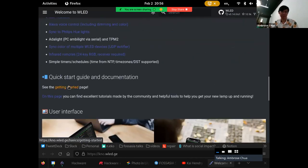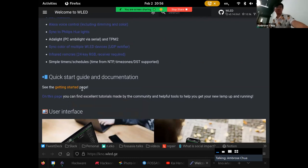All right, that's all I want to show. To be honest, I picked this stuff up by watching a YouTube channel. So if you just check out WLED and buy the stuff and get an ESP32, there are different ESP32s though. I bought the cheapest one, but you can get the better one, the D model. For some reason, it has a bit more memory and it's actually faster. Like you saw in some YouTube videos, when you have a microphone plugged in, the ESP32 does make a difference because it's much faster and more responsive.